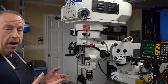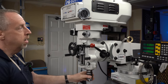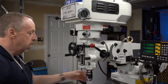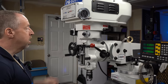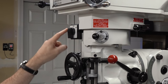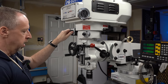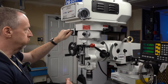Let's start with the spindle powertrain. The whole point of a vertical milling machine is to spin a tool, and so it has a motor that runs through a series of belt and gear reductions down to the tool held in the spindle. I just have a boring bar in here because it's easy to see on video. The motor is controlled with a selector switch that has three positions — stop, forward, and reverse — and it does exactly what you would expect. Forward spins it forward, stop stops it, and reverse spins it in reverse for tools that need to run the opposite direction.